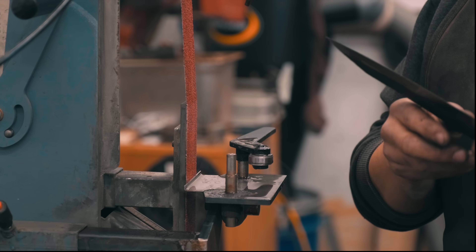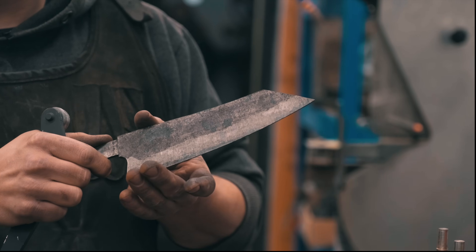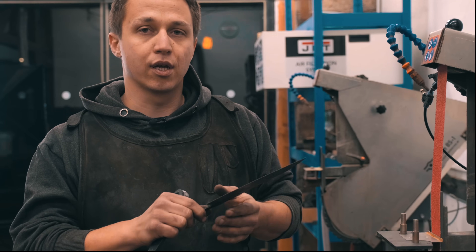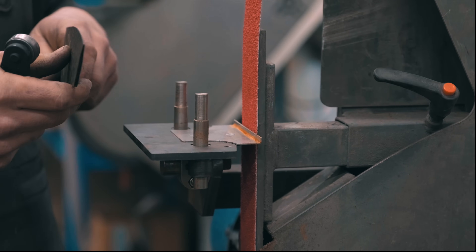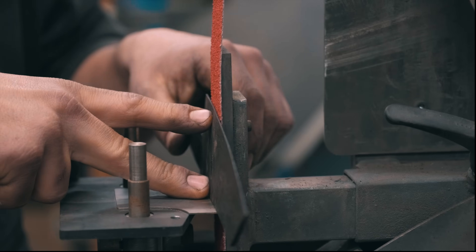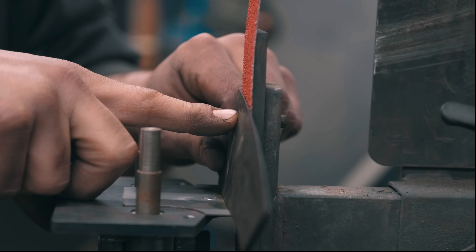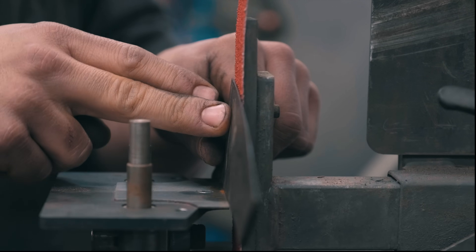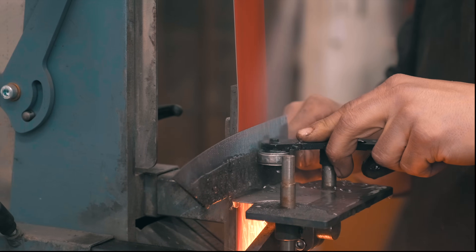Next up is the knife grinding system that I personally prefer, especially for knives that have a wider bevel and are somewhat parallel between the spine and the cutting edge. It doesn't have to be perfect — even a gyuto with some angle in the front will still work. A bunka is perfect because it's almost parallel. On this system, we're not relying on a specific angle, but rather on a distance between the spine and the front of the knife. The height of the bevel gives us the third length that determines the angle. If you put the work rest further away, you get steeper angles; closer gives shallower angles. This jig helps keep the grind lines consistent throughout the length of the knife and keeps the angles exactly the same on both sides, so you end up right in the middle.